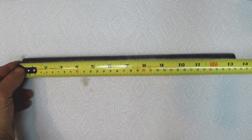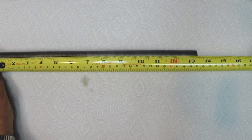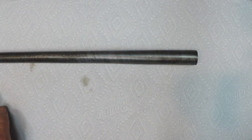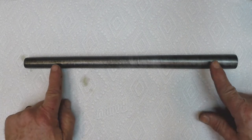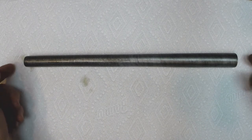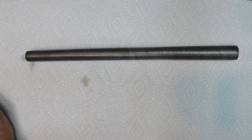And length, I didn't check earlier. We talked about lengthening the tube during the forging. Right now, this wound up at about 13 3/8 inches. So during the entire forging process, that tube lengthened 1 3/8 inches. And again, that even is surprising to me. I'd say due to the softness of the material and the fact that I was using drawn dies and perhaps a process where I was using the forging mandrel inside of it, which gave the dies something to forge against on the inside, that probably helped to promote the lengthening of it, but I don't think that's too bad.